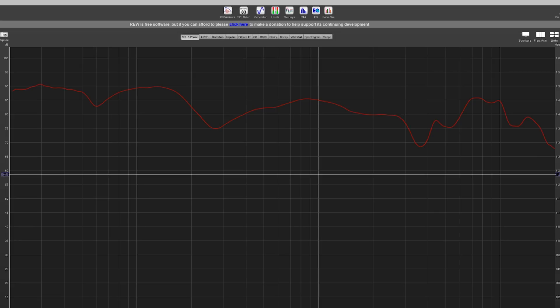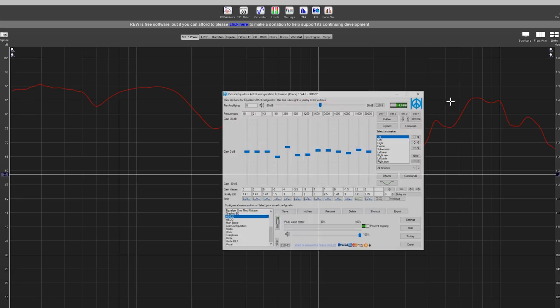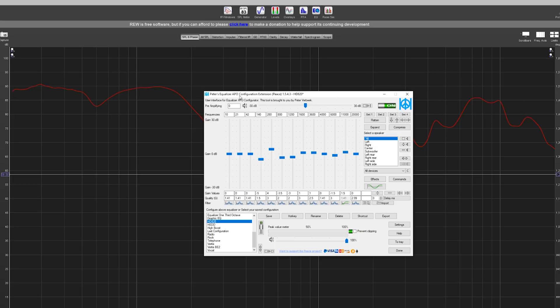What we're looking at here is how the HD 820 measures on the MiniDSP EARS rig using the HPN compensation. As we can see, it measures particularly poorly. If anybody's wondering what I'm talking about, check out some of the links in the description below where you can learn all about frequency response measurements, the various compensations used, and what deviations from targets mean. I just want to show you this — not because this is what we're going to use to actually do the EQ, since I've looked at far more precise measurements for that — but because I want to show you the before and after on this same rig. Let me bring up the Equalizer APO tool that I use; this is the Peace UI for it, which I highly recommend using.